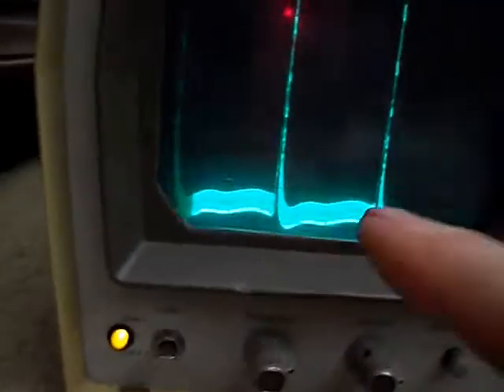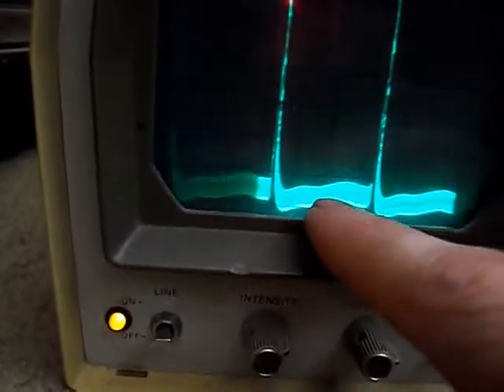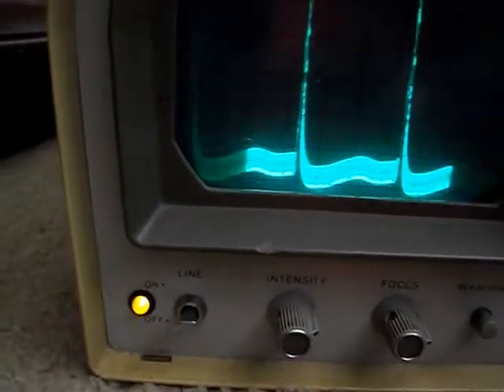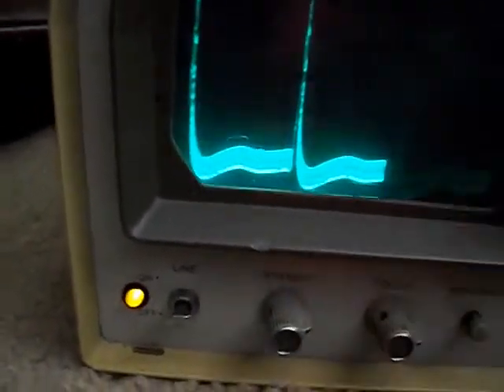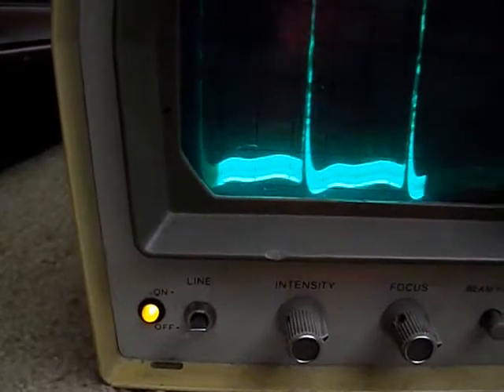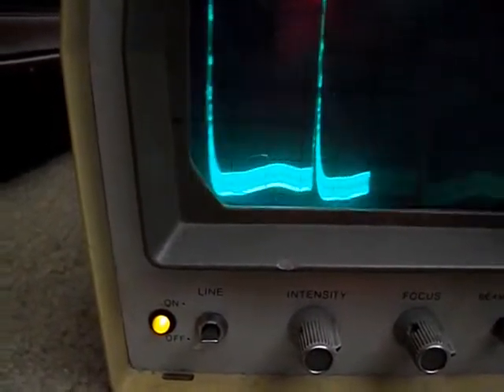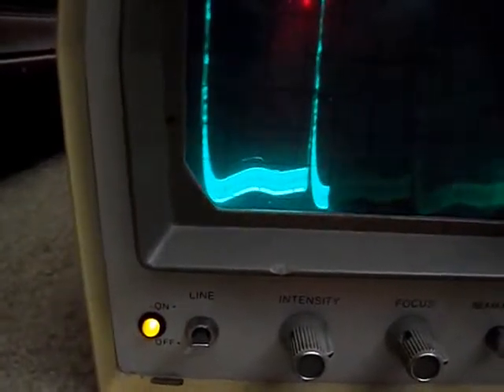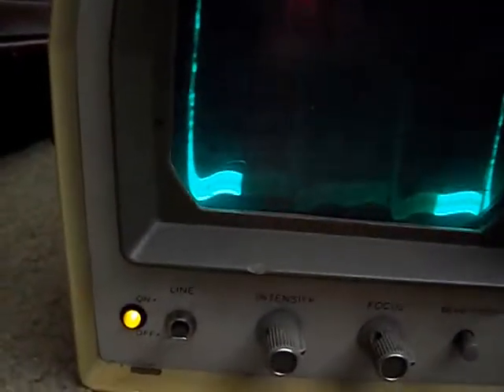This stuff here is not video — if it was, you'd see it moving. What this is, is the unintegrated horizontal pulses. The sync separator has horizontal pulses at the end of each video line, and then when it gets to the end of the frame, it puts a series of pulses closely together. The integrator sees that series of closely-spaced pulses and they add up, essentially.